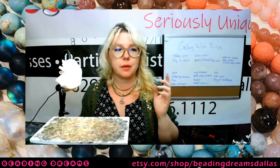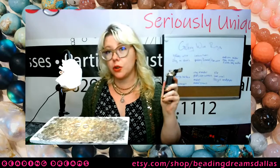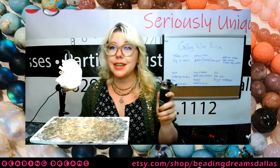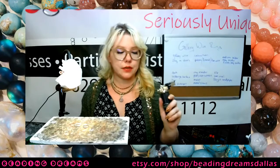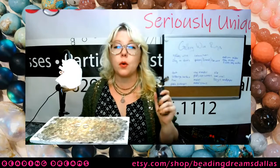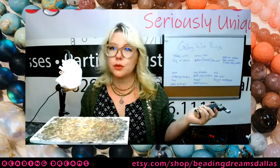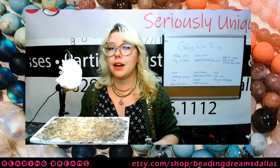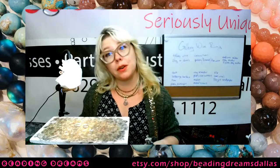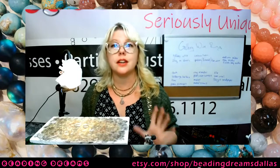So there are lots of factors: your own personal sensitivity, what chemicals you're using, how often you're soldering, etc. Number four, if you're not actively soldering with your torch, turn it off. These puppies are very easy to ignite, and they're very easy to extinguish. There is no reason that you should leave your torch burning and walk away from it. If your torch gets knocked off of your work surface while it's still burning, then you have fire in places you don't want fire. Usually the only place you want fire is in your torch. So if you're not using it, turn it off.